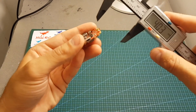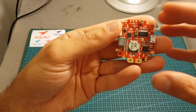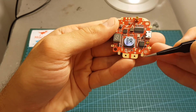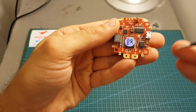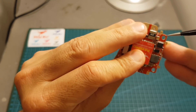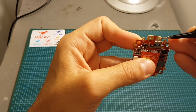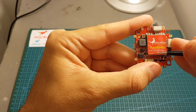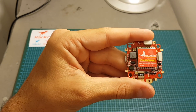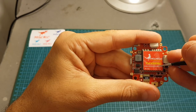The stack height from bottom to top of the MMCX connector is about 10 millimeters. One improvement from the V5 Pro is that the plus and ground pads for the ESCs are now separated, reducing the risk of shorting the board. They also added holes in the center and an option to mount from the bottom. The supported LiPo batteries range from 2 to 6S, and Betaflight OSD has been added, so you can configure the VTX through Betaflight at 0, 25, 100, 200, 400, and 600 milliwatts.